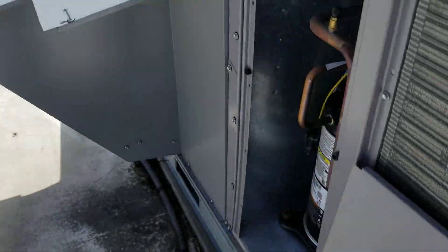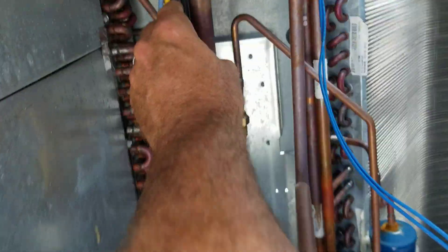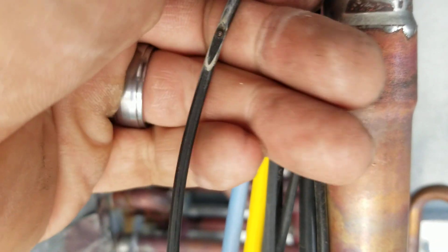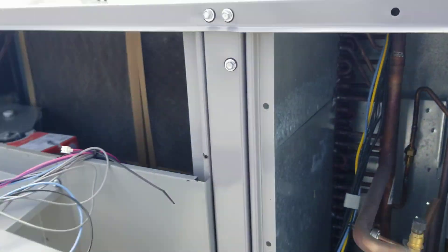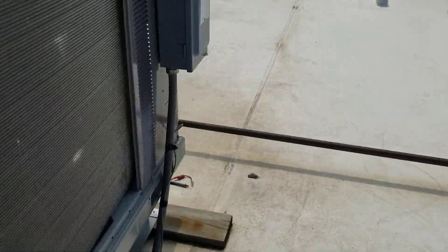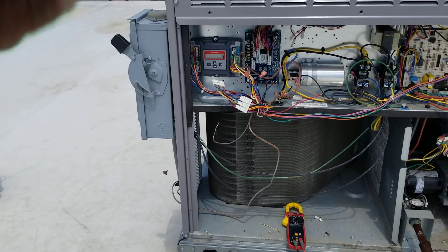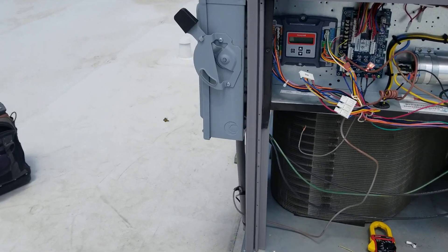This is a 2018 unit, so it's kind of odd. There's my short — right there against the pipe, just wore right through. Right on the braze joint. So we'll get that repaired and we should be good, and I'll put the wiring back together. Just a quick diagnosis on a rooftop. You just break it down to process of elimination and you'll find it.